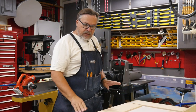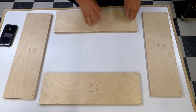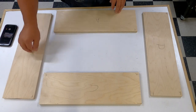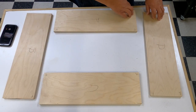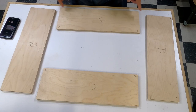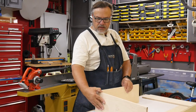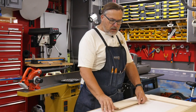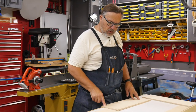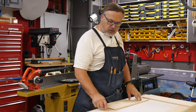As far as layouts, the first thing you want to do is label each one of your sides — it's relatively easy with just A, B, C, and D. The A side goes to the B, B goes to C, C goes to D, and the last two are D to A. You also want to label which one is the top. That way, you know this top corner is going to match up with this top corner. When you're making the cut, you start at the top and work your way down, using the top of the other piece against the next piece it's attaching to, to make the finger joints correct on the second piece.